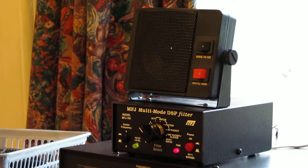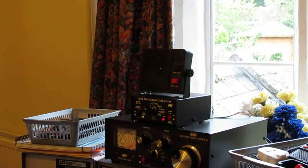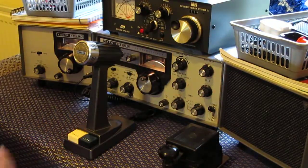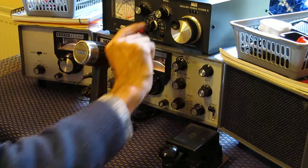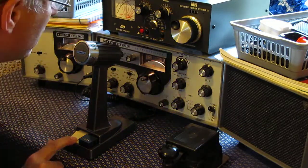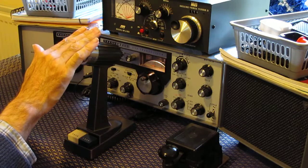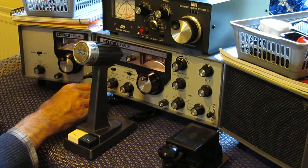The other thing I've added to my setup — I'm just going to zoom out — is the desk mic. I've got the Yaesu YD844 desk microphone. Switching to the dummy load to show you what this microphone works like — and if you watch the power meter, that's about 150 watts through my new desk mic. I replaced the cable — it's a bit short but it's long enough. I don't want RF getting in so I've put a ferrite bead around it as well. I've also got my key wired up for doing Morse.